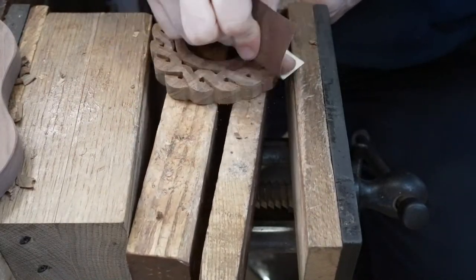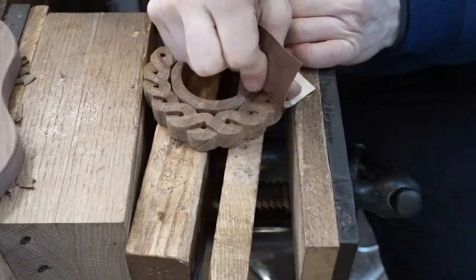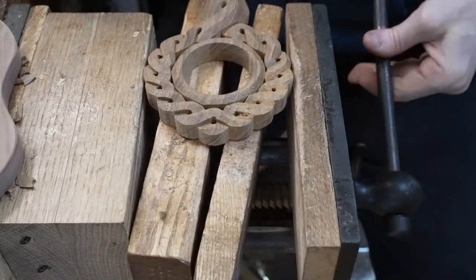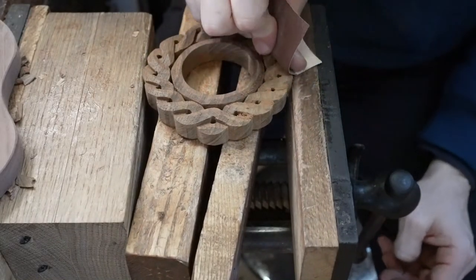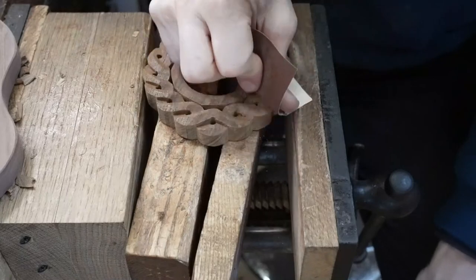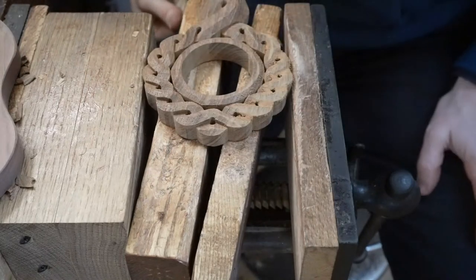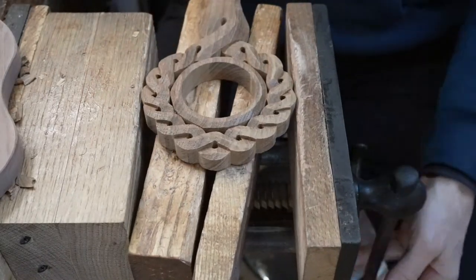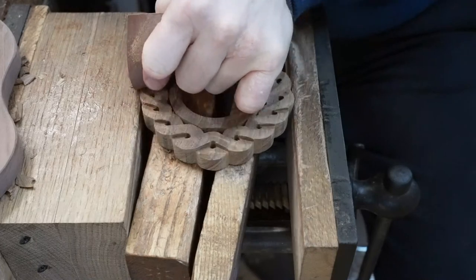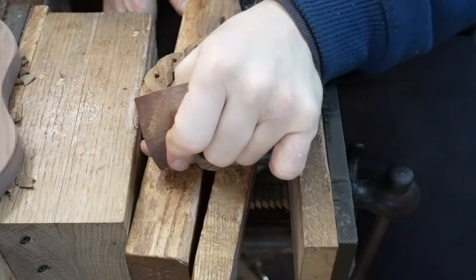We figured out our trials and tribulations with the sandpaper — we believe it wasn't actually our finishing sandpaper, it was the sandpaper I used before. We have the different grades of sandpaper, and it was our P120. So I got a different P120. Hopefully you can see how differently it sands — it's a completely different dust to a lot of other woods. It's much more damp sawdust because it's the oil — it's just so full of oil. I think it's my favourite timber for sanding.